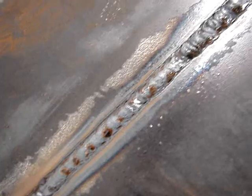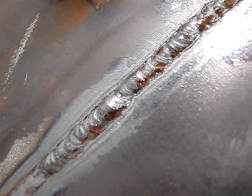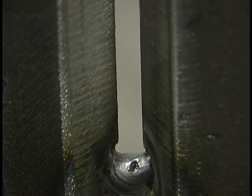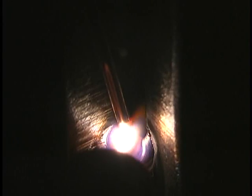Same gap, same settings — using a keyhole dip technique. The reason I like this: I like both actually, but the other definitely looks better. The keyhole dip technique is a little more realistic because when you're laying underneath a pipe and you barely have a line of sight, things need to go kind of slow, and that gives you a sure way of seeing that the weld goes in properly.